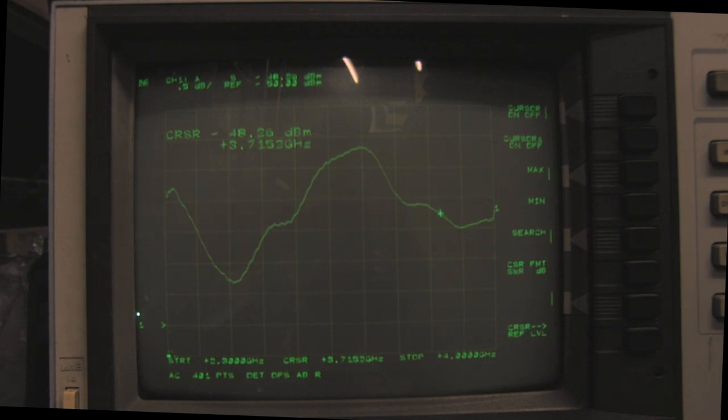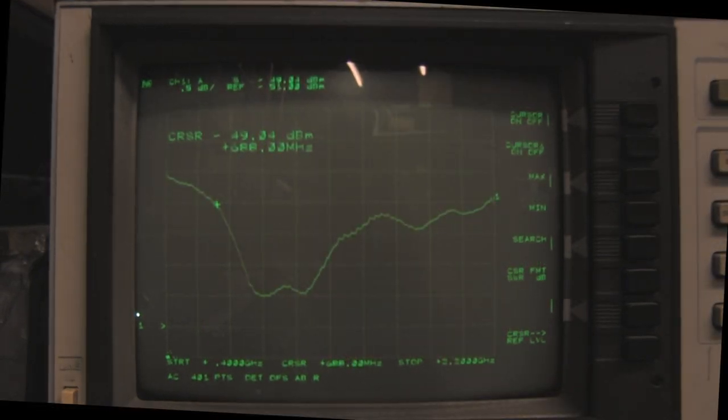This second dip is where your 5G speed comes from. The antenna states 3 dB of gain at that range, which is probably correct. In the first dip — which you can call 4G — it's working at around 4 dB in the 2.4 GHz region up to about 2.8 GHz. So 4 dB in the lower dip, and a slightly weaker 3 dB over the 5G frequencies.